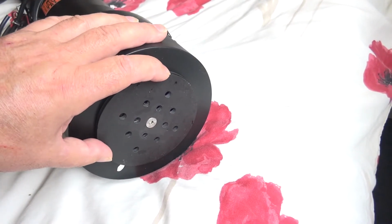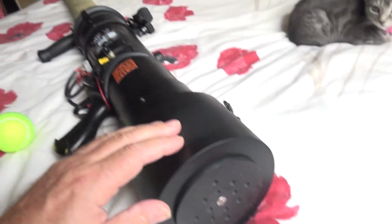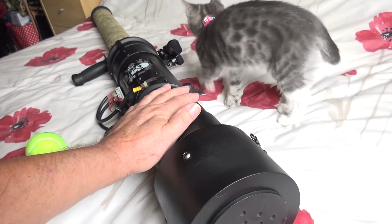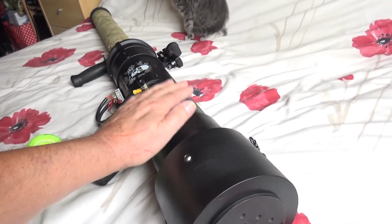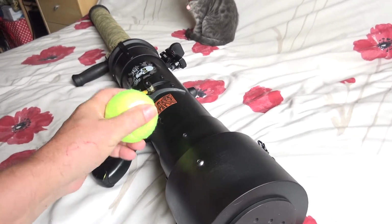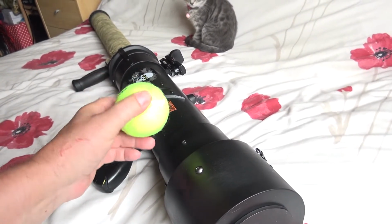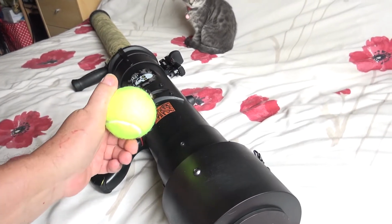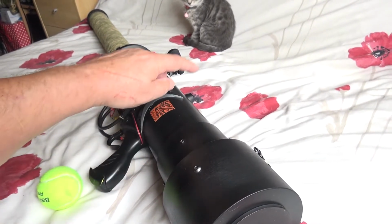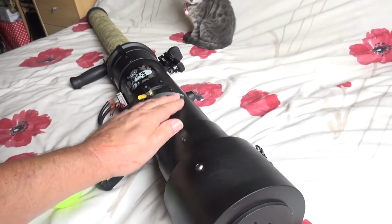So as before, when it's shut and you're ready to fire, you get the explosive reaction which takes place in the breech, and it's quite a force, it's quite an explosion in there which fires this ball out of sight. I can't remember, we did chrono it before we did this mod, and it came out at something like nearly 300 feet per second on the chrono. Perhaps a bit more now that I mix the O2 with the gas, rather than before I just injected a short burst in there and just fired it. Now I'm mixing the gas, there's more of a volatile explosion.